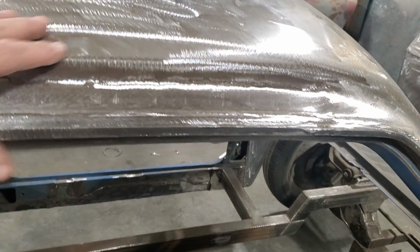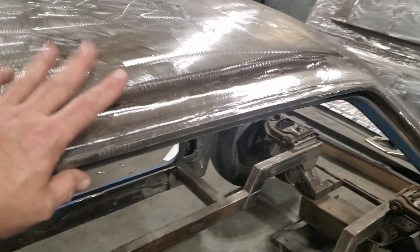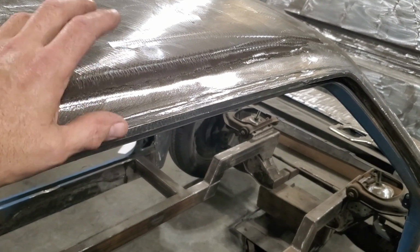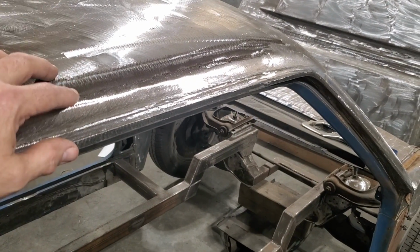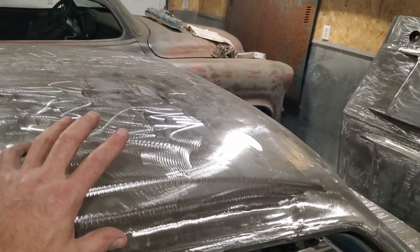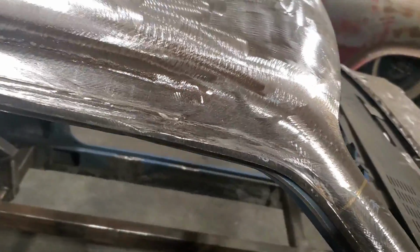Like a lot of vinyl top cars, you find the panels are really bad on them, okay? It takes the vinyl top off them. This is where they get rusty, okay? And it rots out. So you come across a 4-door sedan sometimes, which has had the same roof line as a 2-door. You can actually cut sections out, or even if you had a good roof, take the entire roof skin off it and replace it. There's a number of different ways.